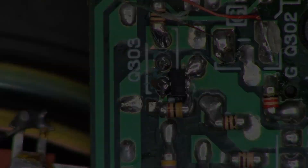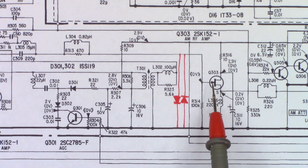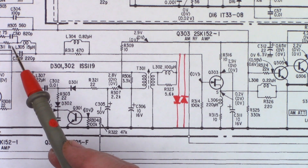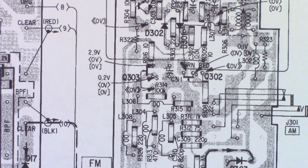There it is mounted back in the original position Sony recommended. In the schematic, the diodes go from the gate to ground in each direction, preventing any voltage higher than +0.7V or lower than -0.7V from entering the gate of this FET, which should protect it. You can see there's a 220 picofarad coupling cap, a 1k resistor, an 820 picofarad coupling cap, and that's the location where Sony wanted us to install the surface mount diode with the anode and cathode, with the common lead going directly to the gate. I'll put one 1N4148 from gate to ground with the cathode facing ground, and one with the anode facing ground — that gives electrostatic discharge protection for this FET.